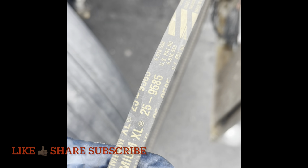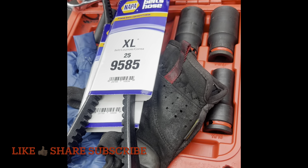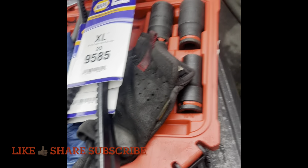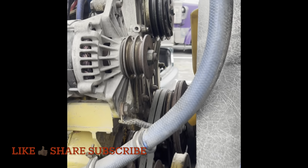Make sure you take note — these belts came out of NAPA, so they're premium. These are 25-9585. That's the bottom belts right here — 9585. Those two gotta be replaced. The 22570 goes on the top.